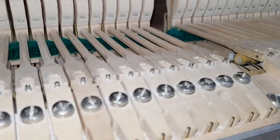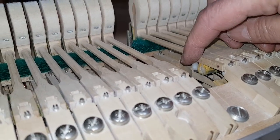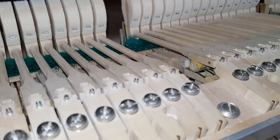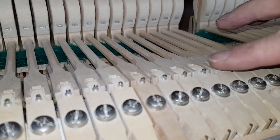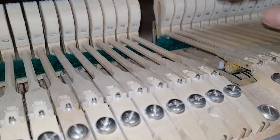We've used dry lubricant on the rollers here, and we wanted to lose about 4 or 5 grams on the weight — it was a bit heavy. I think we've managed to do that. We've also lubricated with Pro-Tec, that's the normal lubricant for pianos, on the pins here.